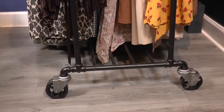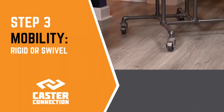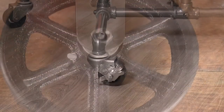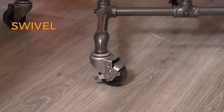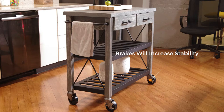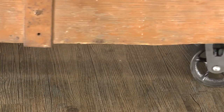When you know the type of wheel tread and the size of your casters, you need to decide what type of mobility options you want with either rigid or swivel casters — we refer to this as rig or fork type. Rigid casters won't turn at all; they just stay solidly in one position. Swivel casters, on the other hand, will move in 360 degrees. Four swivel casters make your piece of furniture very mobile but not as stable, while four rigid casters will only move in a line but are more stable.